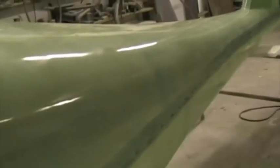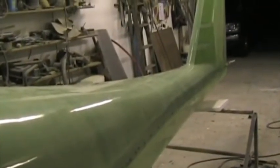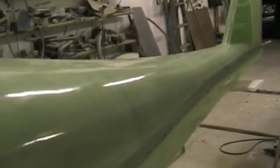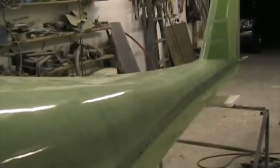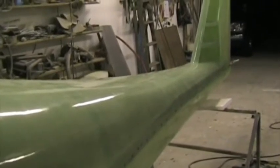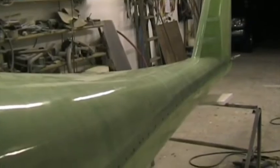The fuselage halves are now bonded together. This took about just over a kilogram of resin and cotton flock mixture. First, I painted all the bond surfaces with a layer of resin, and then applied cotton flock liberally to both surfaces, and then we put the two together, trying not to scrape off too much of the cotton flock mixture, and then inserted all the screws and tightened them.